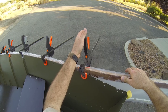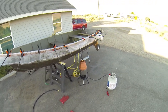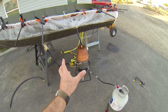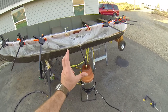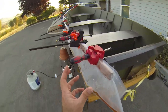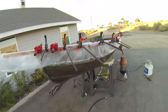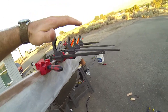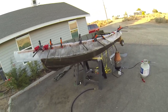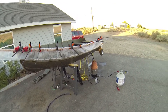It's working great — propane tank, big burner, pasta pot, terracotta flower pot, short garden hose straight up into the bag — heat, steam, tension. This side is all the way curved and right up against the middle. There's a compound curve: in the back it curves up and in the front it curves down. It's all the way up against the body. It's been cooking for about half an hour, so I'm gonna let the heat go until I run out of water, let it get good and used to being in that position, then let it cool off overnight. By tomorrow that rail will be done.